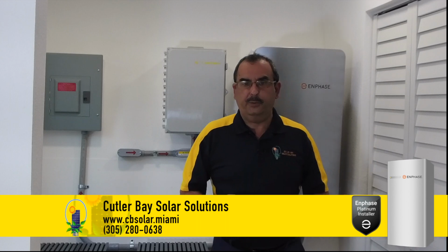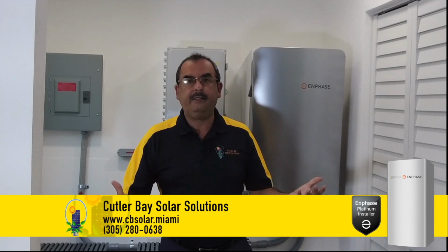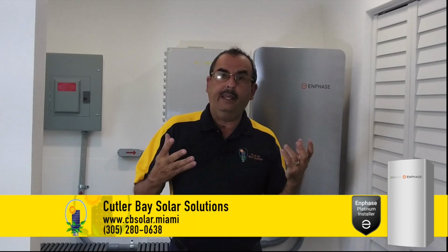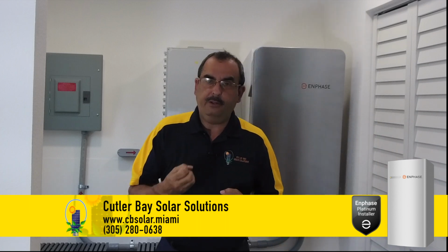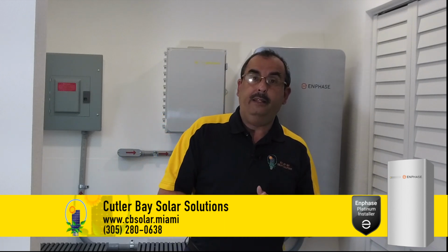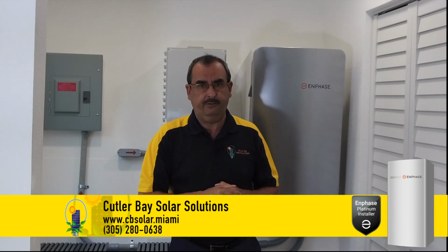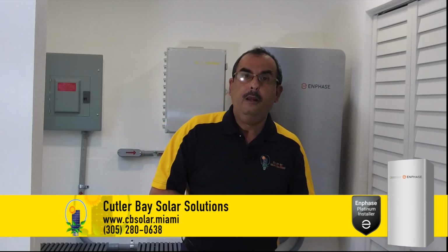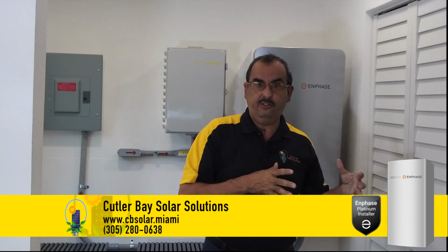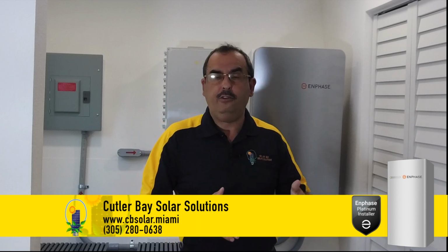So everybody talks about the differences between products. And Tesla PowerWall 2 and the Enphase Ensemble in charge have some very significant differences between them. First of all, the chemistry. Tesla PowerWall 2 is a cobalt-based product. Cobalt is a chemical that we have all heard about on the news, the phones, the e-cigarettes, and the ability to catch fire because it overheats. And let me tell you, the Tesla PowerWall is a very safe system. I'm not going to sit here and try to tell you that it's unsafe. It is cobalt based. And therefore, they have to have a mechanical device, a fan, cooling the battery at all times. And if that device was to fail, you may have potential issues in your home.